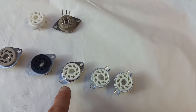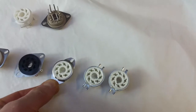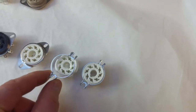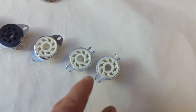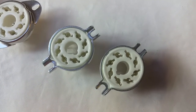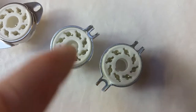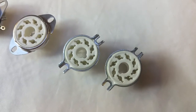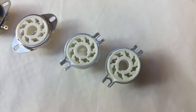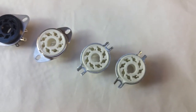The difference between these three is this one has a fixed mounting bracket on it, so it doesn't come off. These two are actually the same — the mounting bracket comes off and you can put it in either orientation. Look at where the locating pin is with regard to where the mounting holes would be for the bracket. That could be useful if you're trying to make a layout work, or your chassis holes aren't exactly where you think they should be. You can rotate the socket 90 degrees just to get the pins where you want them.